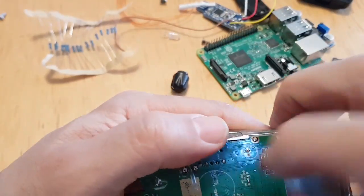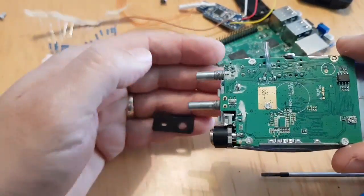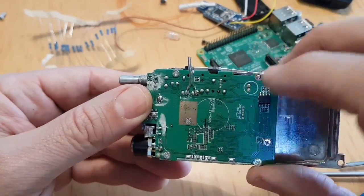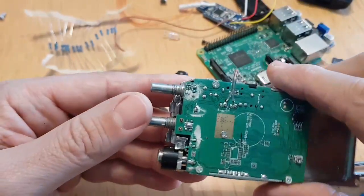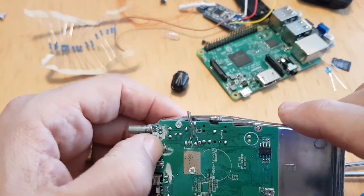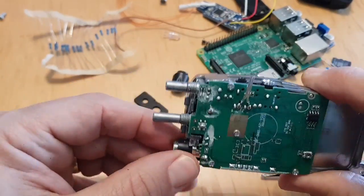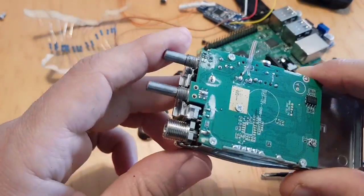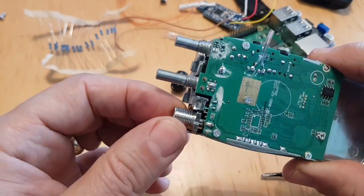And then, you know, we need to make sure that those microphone connectors aren't touching. We'll need to remove these two wires. Now, there's a connector here that we use. So I'll show you that close up when we're doing it. So this is the board we're interested in. We've got a few screws here to remove. We've got a bit of solder. We need to remove this solder to make the board lift off. This plastic thing just comes off. The antenna, what G7RPG does, he solders an antenna here. But we're not going to do that in this case.